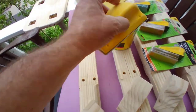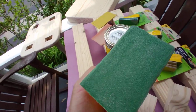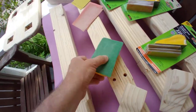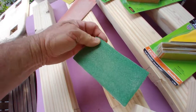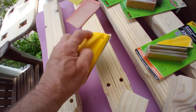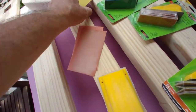What kind of sanders do I have here? This unit here is from Gator Company — I'm not sponsored by Gator. This is either a 60 or an 80 grit. The beauty of these newer types of sanders is they're hook-and-loop, and you can just pull it right off and put it back on again. This is spongy, so your hand doesn't get tired, and it will also adhere to the contour of what it is that you're sanding.